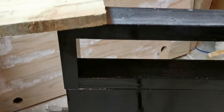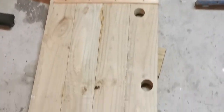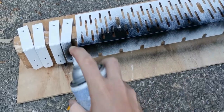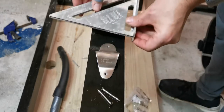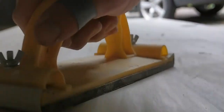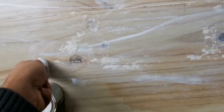With the legs, I'd originally planned on painting them white to match the cable trays, which were powder-coat white. But through the design process I decided they'd look a lot better glossy black, so I painted them with black oil-based paint. I then went back and painted the wire trays with the same black paint — tricky because I had to prime them first, then use the oil coat on top for extra protection against wear and tear. I thought it would be cool to add a bottle opener on the leg of the desk, so I purchased one for about five bucks and attached it. For the desktop, I meticulously sanded it with several different grades of sandpaper, then used linseed-based putty mixed with some white paint to fill all the gaps, and applied a white varnish which brought out some really nice green colors in the wood grain.